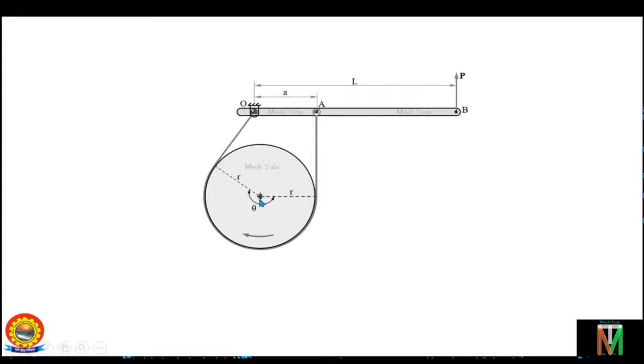The radius of the drum is R. So these are the construction details, and suppose now this force P is applied, this portion will move upward in this direction as shown, so it will get tightened. So we have this as the tight side and this as the slack side. There will be tension T1 in this belt on the tight side, and tension T2 in the belt on the other side, which will be less than T1 — so it will be the slack side.